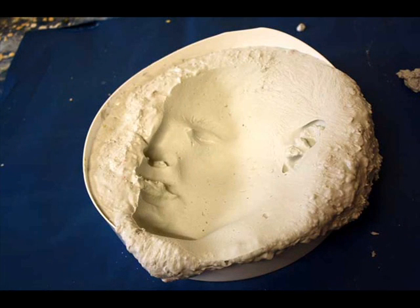This technique is called a clay press. First of all, I made an impression in Alginate of half my face — I did this in the same way we did the hand, just by putting my face into a shallow bowl of Alginate. There are other better ways, possibly by having an assistant spread it on your face, but remember you need to put straws up your nose or in your mouth so that you can carry on breathing while the moulding process is taking place. To keep this example easy, I just put half my face into the Alginate so I could still breathe through the other side of my mouth.